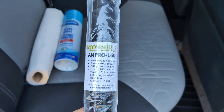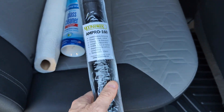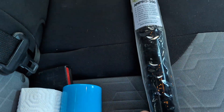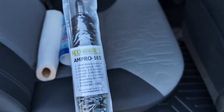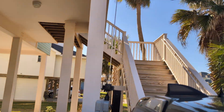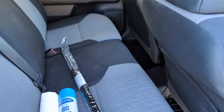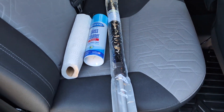The CQ Worldwide 160 contest starts in a couple hours and I have this antenna that I bought on the suggestion of M0PLX, Old Jack. He suggested this antenna for 160 mobile — it's about your only option. I didn't see any reviews on YouTube for it, so I thought we'd give it a shot. I'm going to replace the good old 102-inch whip with this antenna. I hear they're very narrow-banded, obviously, because there's a lot of coil to it.